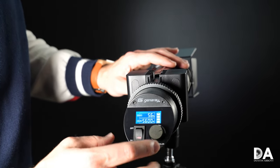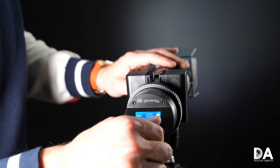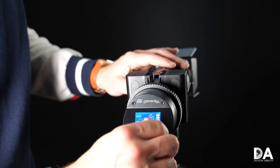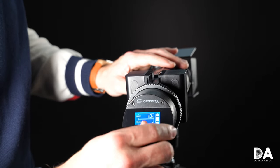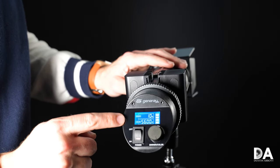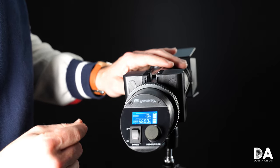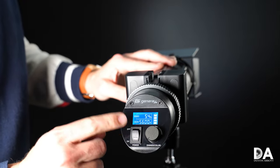At the back, you've got your control for both power and color temperature. You can dim it anywhere from 100% down to 10% in one percent increments. If you click the control, you can also change the color temperature Kelvin value from 5600 to 3200, and select anything in between. If you're just shooting stills, any value in between is fine. However, if you choose a value other than 3200 or 5600, you will catch some flicker on camera. I shot some footage before I was aware of this — I set around 4000 Kelvin trying for a slightly warmer look, and ended up with flickering on my face. It's flicker free only at 3200 on the warm end or 5600 on the cooler end.